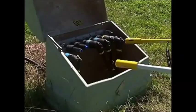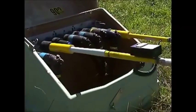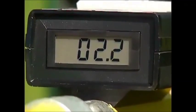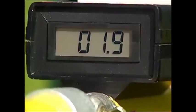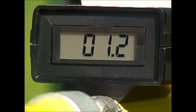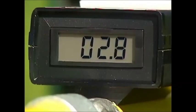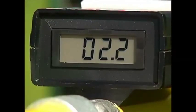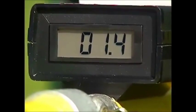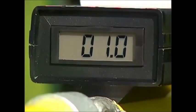Let me go into the non-metered end into the cable to be tested and energize that DC high-pot. We've got good initial current flow — it's accepting the charge, then dropping to a low value. It's obviously a punctured cable. It's dropping back off again, fluctuating — accepting the charge and then discharging it. So we have three situations: a good cable, a fully faulted cable, and now a punctured cable.